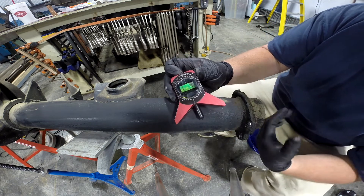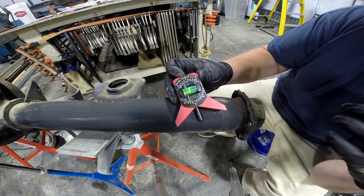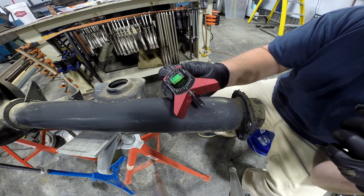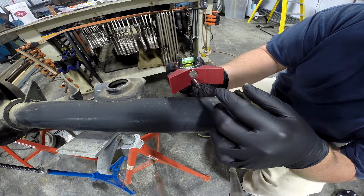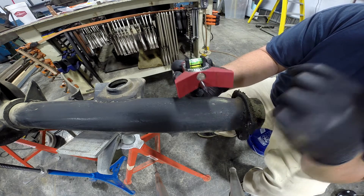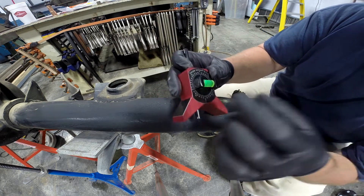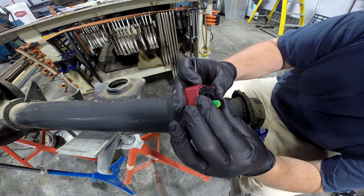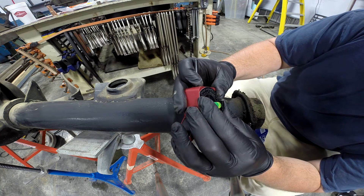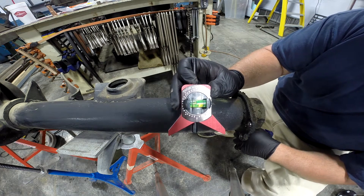This tool is something that's typically used by pipe fitters, and if you're familiar with my channel, you realize I'm not a pipe fitter. But I'd like to show you what I use something like this for. I want to point out that there are magnets — one is located here in the center of the V, but there are also magnets located in each leg. So what we're going to do is set this spirit level on the Flange Wizard to 90 degrees, or zero.